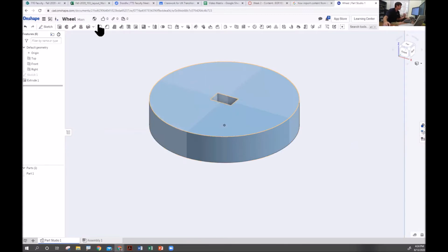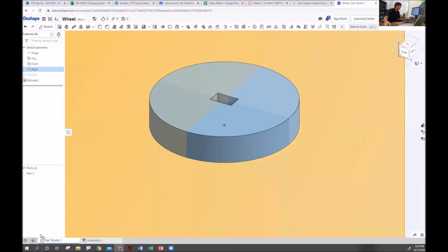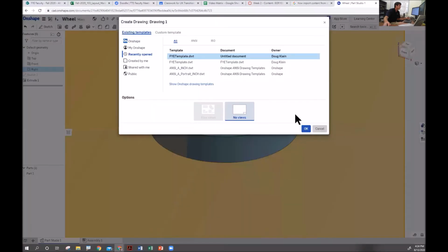I could go in and add some fillets here that will round these interior corners. And in my perspective also, I'm going to have to mess with the size of this hole to get a really good and tight fit on that stepper motor. Because what will happen is, depending on the wattage of the laser, might cut in different widths, and I want it to be snug. So, but to get it to the laser, what we're going to do is I'm going to create a drawing file. It doesn't really matter what template we use in this situation.